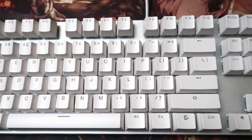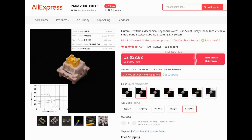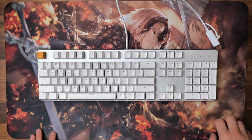More specifically, it came with brown MX switches which are fairly quiet and tactile, but I wanted it even quieter, so I went on AliExpress and got these very quiet switches that were called Silent Peach. I'll leave the link in the description for everything that I purchased. In addition to the switches, I also got the Arknights keycaps from AliExpress as well. Feel free to use any other keycaps that you find, but before you buy them, make sure they're compatible with MX switches. After you've selected your frame, switches, and keycaps, it's time to start the assembly.